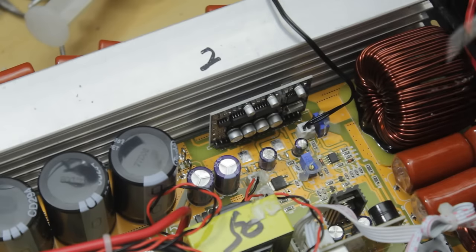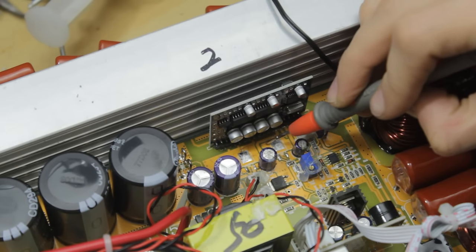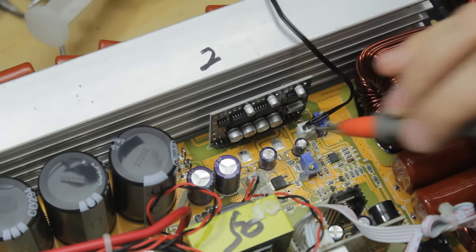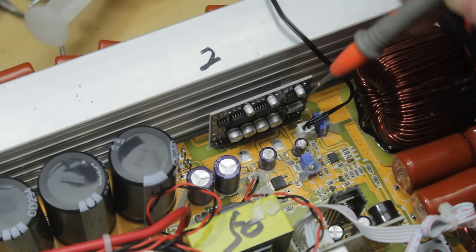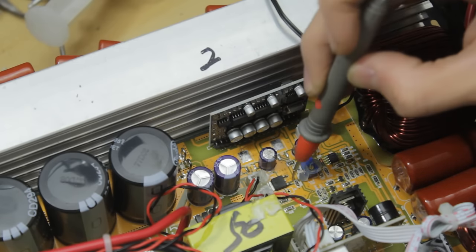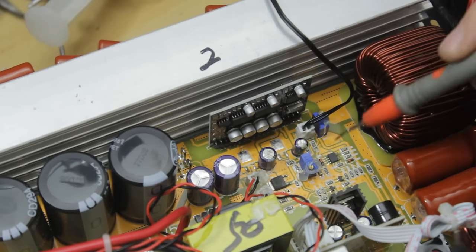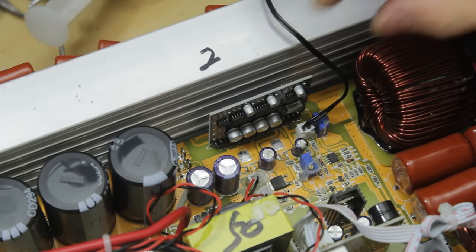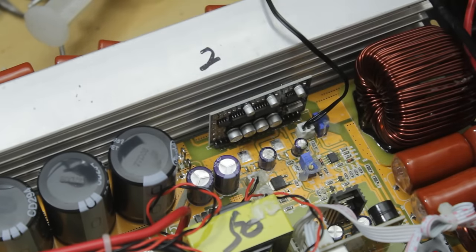Now I've got a couple of choices here, and which one I choose will affect the repair cost of this device. So the easiest thing would be just to run a little cut through this trace here that leads from the regulator output pad to this driver card. By cutting a little slit in this trace, I can isolate this card on the 12 volt supply line and see whether the short is actually on the card or on the mainboard. And then once we're finished with the repair, we just run a tiny solder blob over the top of it. That'll keep the repair cost down as it's nice and quick. Alternatively, I can remove this whole PCB out of this case and desolder the daughter board to have a good look at it and isolate it that way, but that will take longer.